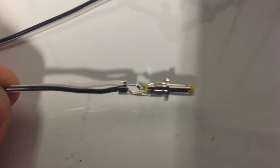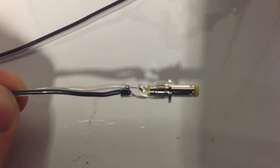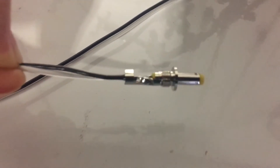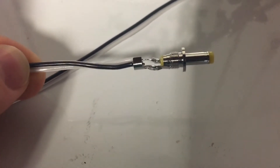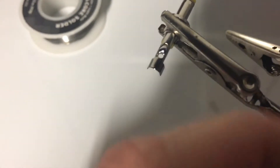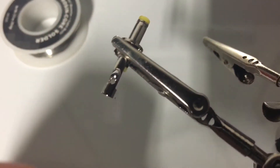We're outside right now to do the soldering, and you can see how I have the white wire going to the middle terminal and the black wire up onto the outside on the outer terminal. So I have white as my hot and black as my negative. I got this one done and I'm just going to go ahead and do this one. Just remember when you're soldering to pre-tin the terminals — it's going to make it a lot easier — and also to pre-tin your wires. So we're going to go ahead and do that one too real quick.